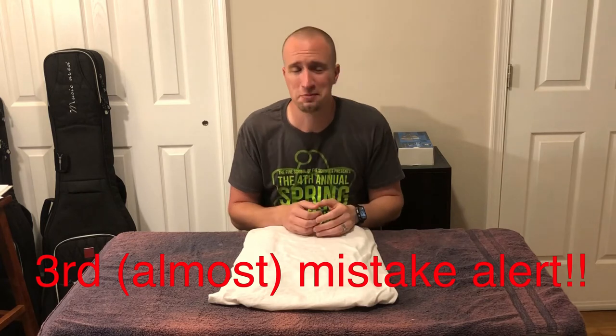But I ran into another problem — I ran out of spray paint. After that second coat my spray can ran out and I couldn't run out to the hardware store for a replacement, so I thought that might be enough. I let the guitar dry for a few more days, then began to very carefully wet sand that last coat. Now I just had orange peel — just the inconsistencies of individual droplets of paint — and that 800 grit sandpaper does a really good job of lightly working it into the body.